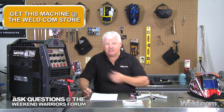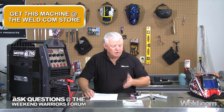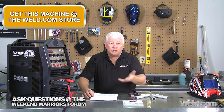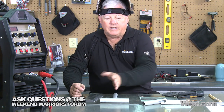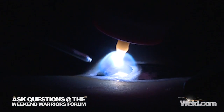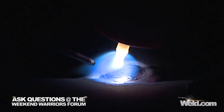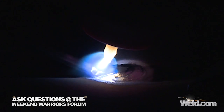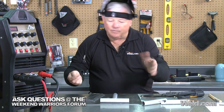I've got an ACDC machine here, and I would have to identify every parameter on the sheet that I'm using. I'm going to put my gear on and weld up this cluster to show you what it should look like. When you do a cluster, it's probably best to do the 90-degree one first, because eventually you have to put in the 45-degree angle. I welded this all the way around — it doesn't matter what position you get into because you're going to have to manipulate around the tubular, so it's basically all position. Make a complete weld, and then the second part is putting the 45s in position, testing your skill in tying into the root of your weld.